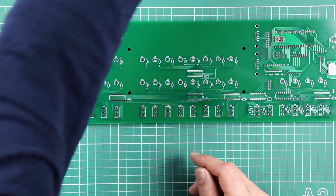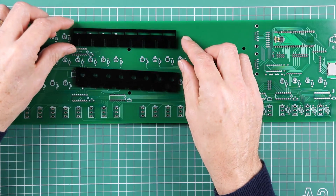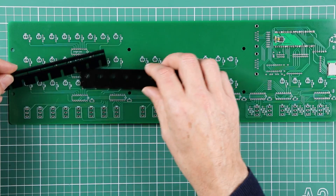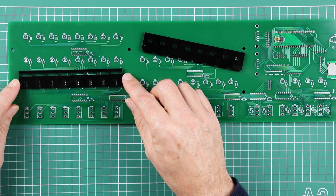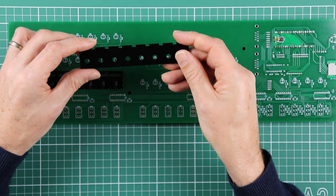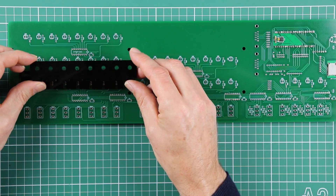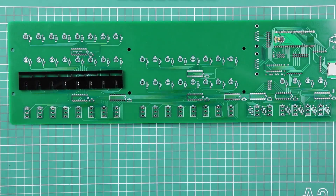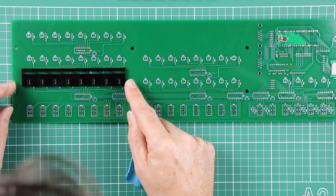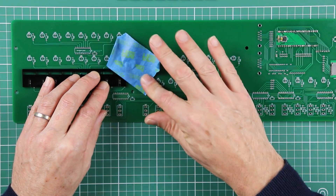There are two smaller pieces of black acrylic in the kit that are going to aid you with aligning the LEDs. The piece with horizontal and vertical slots will be used behind the LEDs to stand them off the circuit board by three millimeters — a little over a tenth of an inch. The sheet piece of acrylic with the eight five-millimeter holes will fit over the LEDs to ensure good alignment before you solder them in place. Place the slotted piece over the LEDs so you can see the two vertically aligned pads for each LED, then use some masking tape to tack it in place.